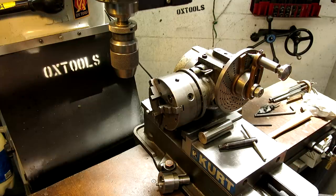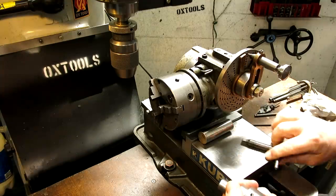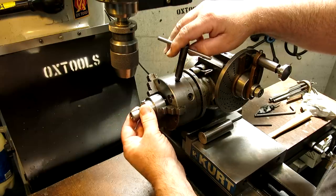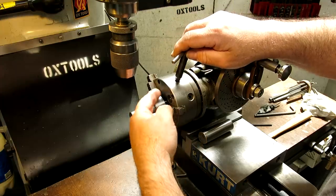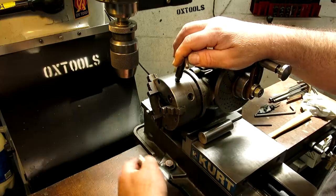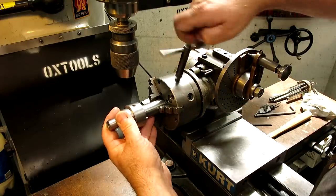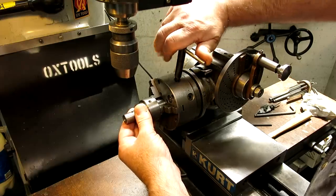Now Bozo came to town here, and he was so excited about pushing these pins in here and trying it that Bozo forgot about the next step, which was putting this in the indexer here, and now that is foiled slightly by the fact that he's got some pins sticking out, and I can't sit it back against the face of the chuck here, so I'm kind of annoyed. But the workaround is, this fits a 1-inch diameter shaft, so we're just going to put that in there like so. And now I can sit against the jaws here.